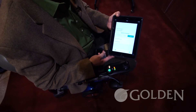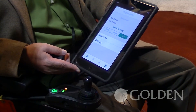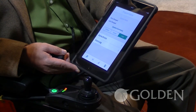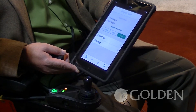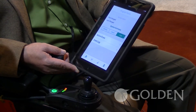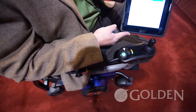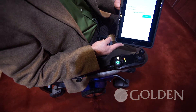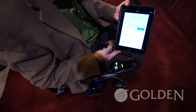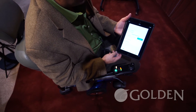What the Lynx Dynamic is, it's basically load compensation technology. It's where the electronics is controlling the speed of the motors, so what that means over time, it's actually adapting to the end user's driving capabilities over time — different terrains, different inclines, even patient weight. The chair will perform to the client's needs, to the best of the abilities of daily operation.